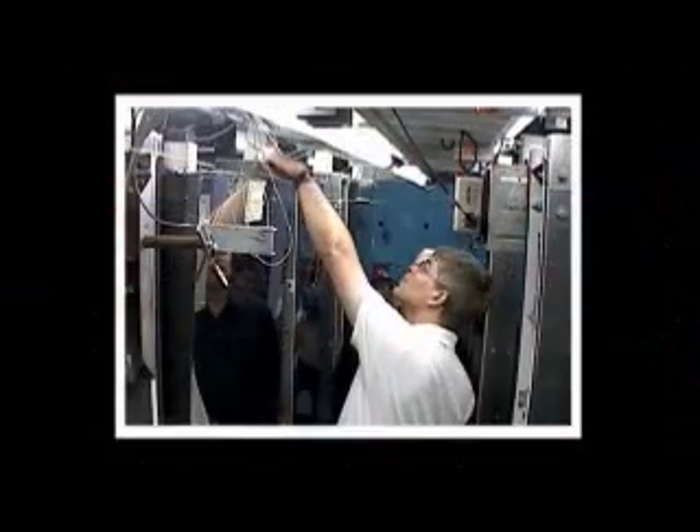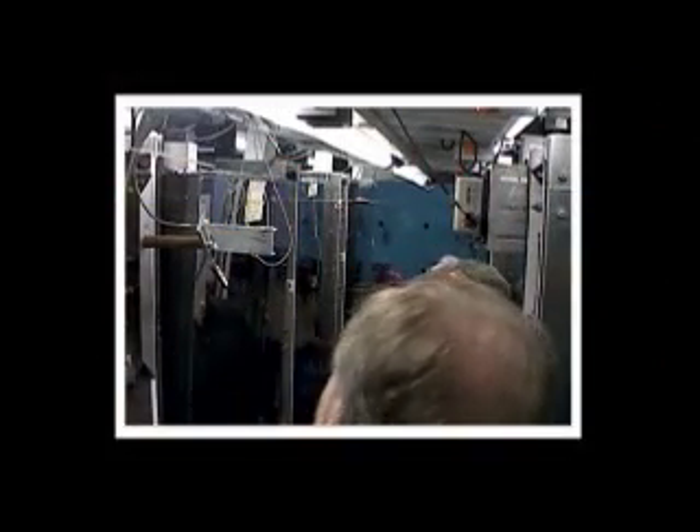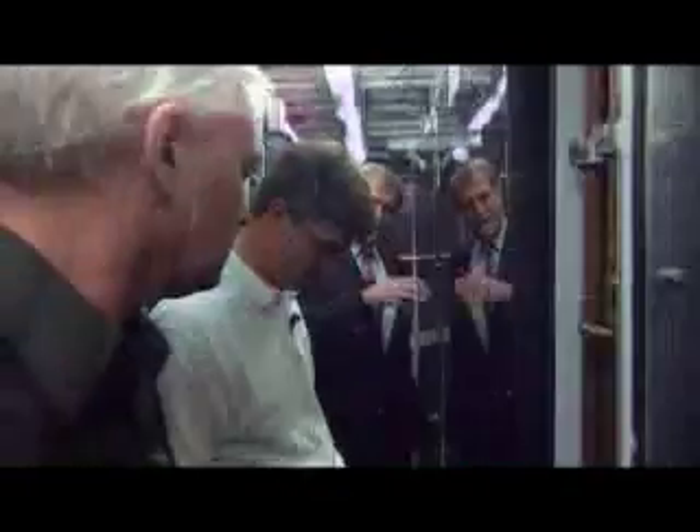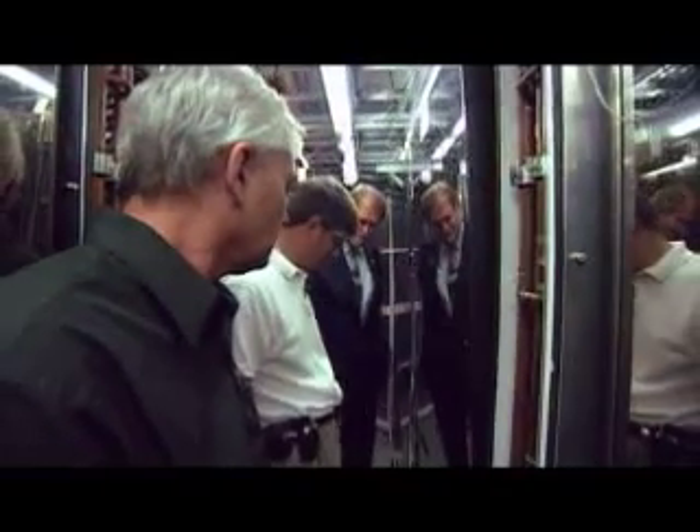The black box went through its first real earthquake. We saw two things that occurred that we're going to go fix. One is that some screws pulled loose in a cable tray — this is how we mount the cables above the racks, and that shouldn't happen. The other thing is that one of the racks that was very loose moved around enough that it got slammed into the adjacent structures, and some of the grill work in the front of the rack got damaged. A rack shouldn't pull loose like that, but there are things we can do to make sure it doesn't get so torn up.